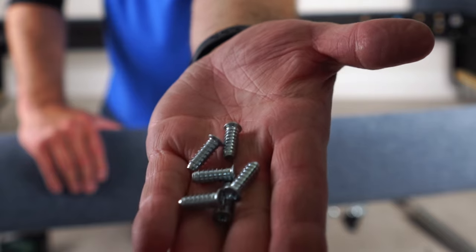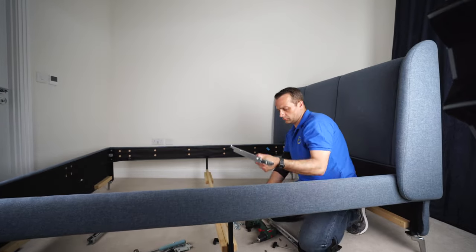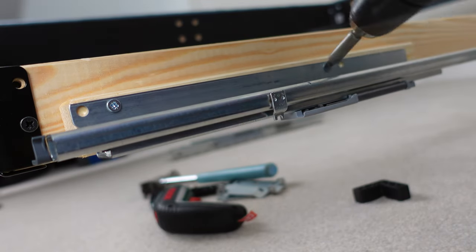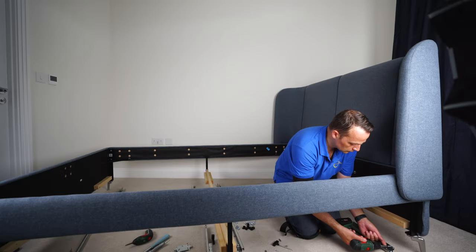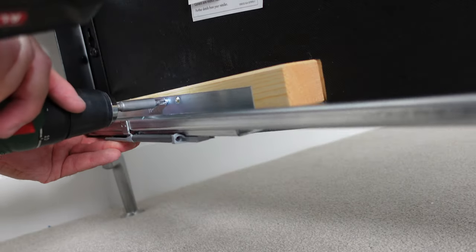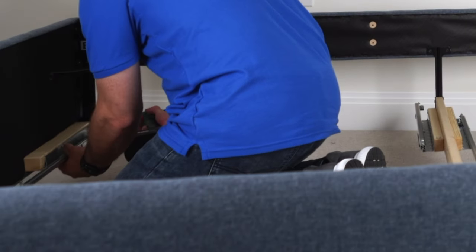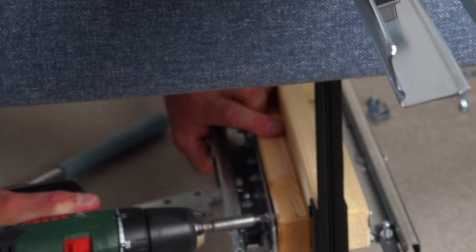Now we're going to need those rails, screws, and the rail. This is the back of the rail and the front of the rail. The screws come in through the second hole from the front and we secure it into the wood we just connected between those brackets. Don't mix up front and back — the hook is the back for all drawer rails. Secure each rail with two screws. You'll have four drawers, two on each side — eight rails in total. The last one on the middle: two screws, one on the front and one on the back.